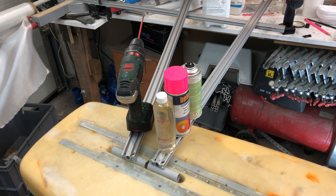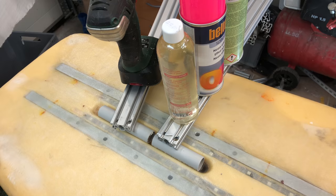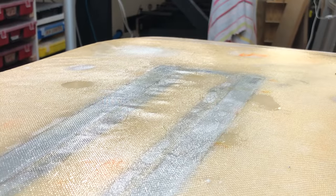To keep the glass down inside the cable channel, I sprayed some conduit with mold release and put that into the channel. I weighted everything with a few bottles and that worked pretty well. Did I mention that this was messy?